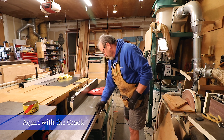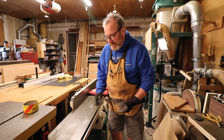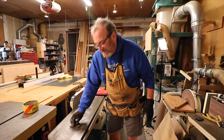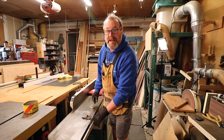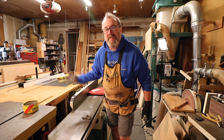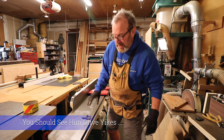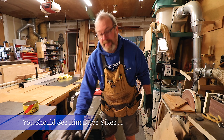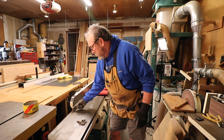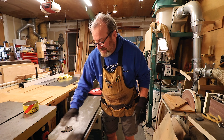Don't forget to do the crack. Another thing that happens sometimes on joiners is the edges get banged really bad. This thing weighs like 700 pounds — it takes like three people to move it. Sometimes this gets hit by falling wood, or something hits it. I hit it with the planer one time pushing it — boom. So if you have a metal file and you've got a burr on this thing — and you'll know it when you run something over it — file it off with a metal file and then sand it with like a thousand grit sandpaper. Your wood will thank you.